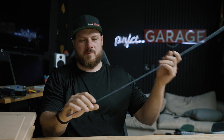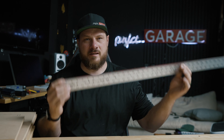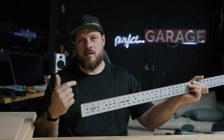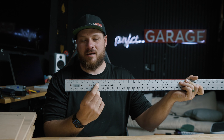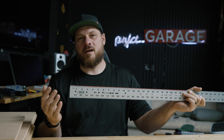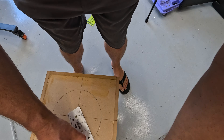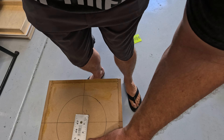A sharp pencil is going to be super helpful as you make some of the sketches on your pieces. And then a simple tool that you are going to need for just any shape subwoofer is your jigsaw, so that you can cut out the hole. Something I'll recommend which is huge — you can obviously buy templates, but those can get pretty expensive unless you're planning to open a shop. Grab a good straight edge, a ruler, and drill a hole at the one-inch line. Look up the diameter of your subwoofer mounting hole, and then drill a hole halfway to that point. So for simplicity, an eight-inch sub you would go four inches deep — actually five inches since you're one inch in — screw the center into the part you're gonna make the hole, then trace the circle. It's gonna give you a perfect circle every time.